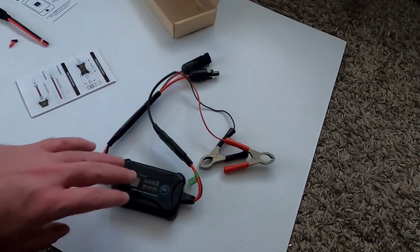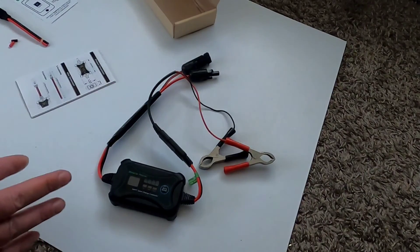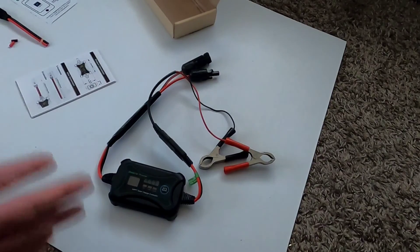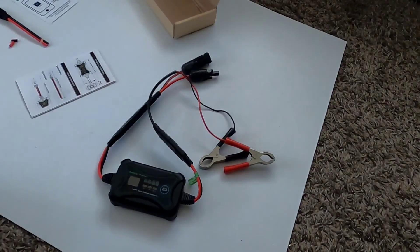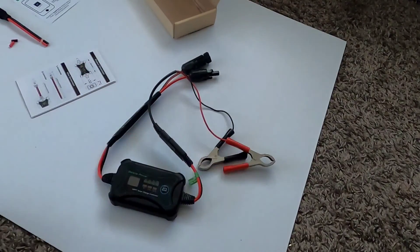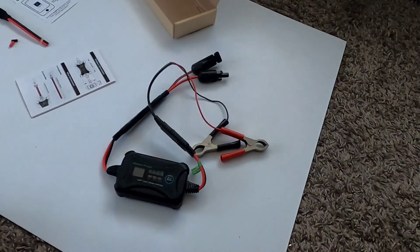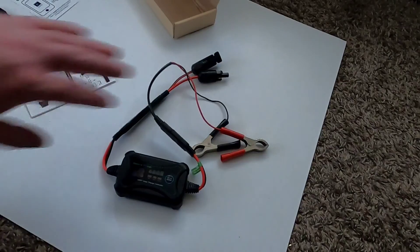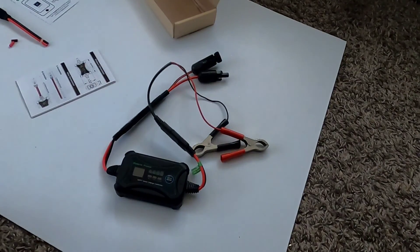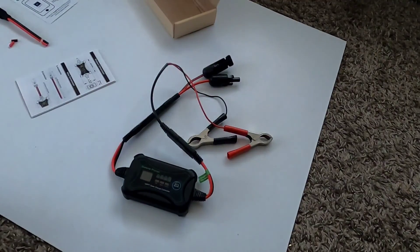I like having these simple units. This is only rated for 10 amps, so you don't want to go above about 150 watts when hooking up solar panels - it's a smaller scale setup. For my 100-watt folding solar panel it's a great fit. I like that I can quickly hook on my gator clips to pre-existing gear and connect any 12-volt battery - Gel, AGM, or lithium iron phosphate - to my folding solar panel.